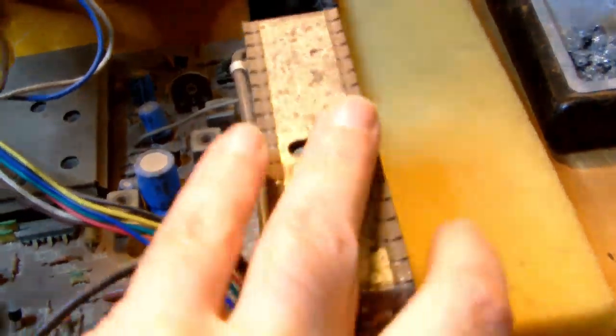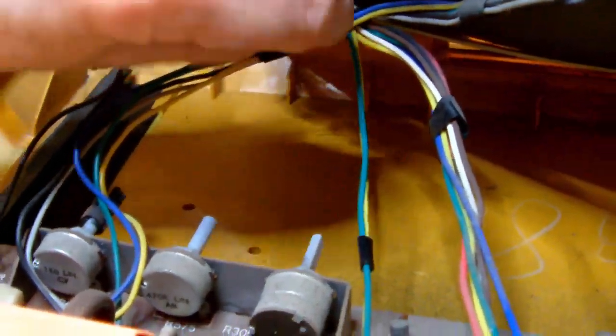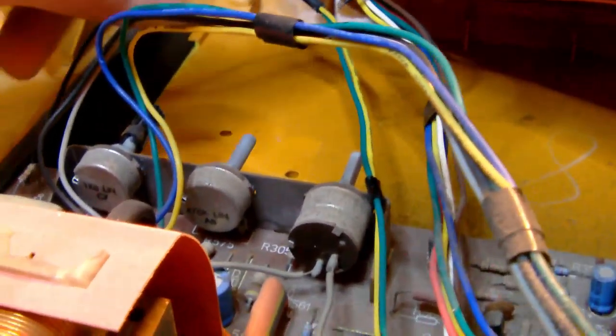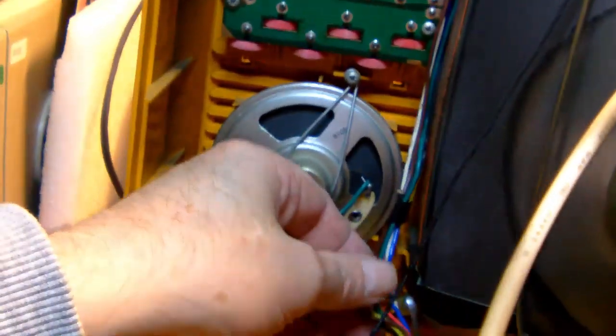Yeah, it's coming along. Yeah, almost there. Yeah, there it is. Okay, wait, I need to unbind the wiring here. There you go. Okay, because we don't want to destroy the TV, do we? So I unbound the wires, so we give a little tug here. So dressing of wires is important, you know, because if you dress the wire loom properly, you will get much less interference afterwards.